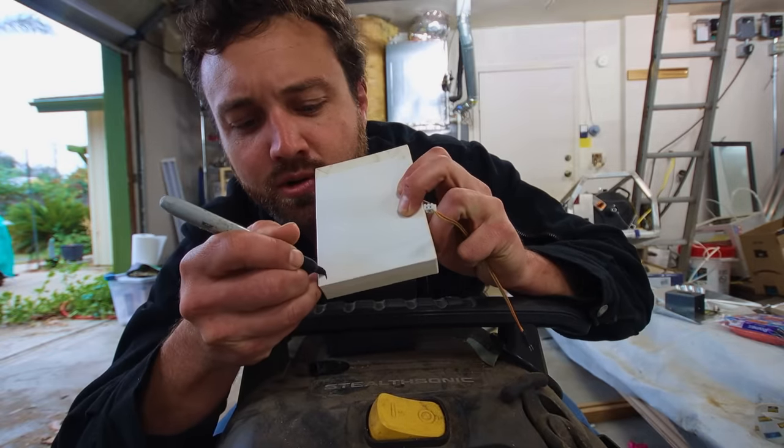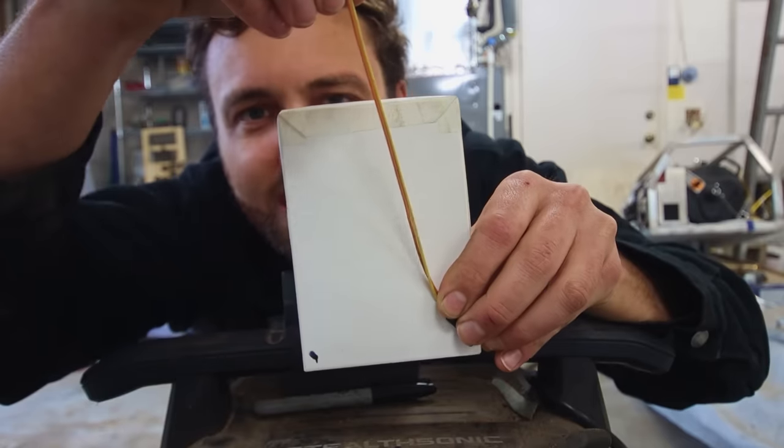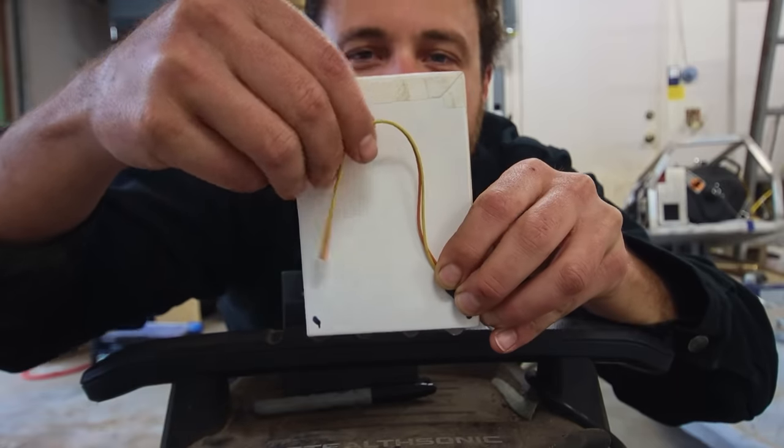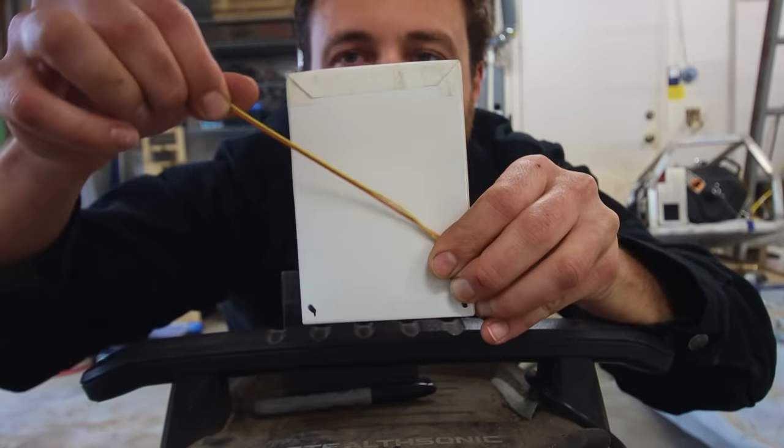So this is your shipping container. You got your little corner hole here and your corner hole here. You lift it with a cable going from corner to corner, and you lift it from the middle. You have a load horizontally — so this isn't pulling up, it's pulling that way. If you put a bracket on the corner and you lift it at an angle, it wants to pull it in. But since you have a triangle, if you lift it from low down instead of high up — which is how I have to do it with the tractor or excavator to get the most lift — the horizontal load becomes enormous, like 4,500 pounds. So now your bracket is working less hard vertically and more hard horizontally, and you need more metal. We actually, it's just all covered in rust, and we don't want to clean the rust off of it.